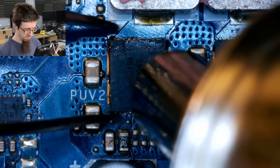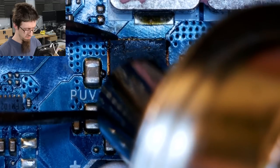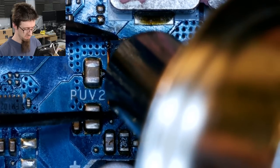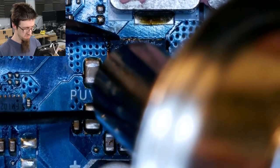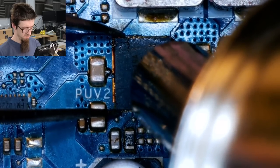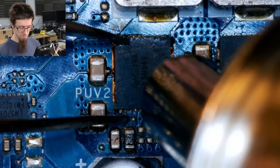The other thing here is that while I'm not completely wrong about spotting the GPU vCore rail being very, very close in resistance to the main rail short, the reality is that 30 series GPUs actually have this kind of incredibly low resistance. I was expecting just under an ohm, but on 30 series, it really is like 0.2, 0.3 ohms. So that's going to be almost impossible to identify from a shorted power rail. So I'm not wrong in trying to confirm that the GPU isn't shorted, but if I'd been looking elsewhere at this point, I'd have found much, much more obvious symptoms.